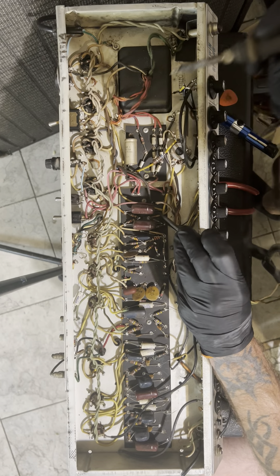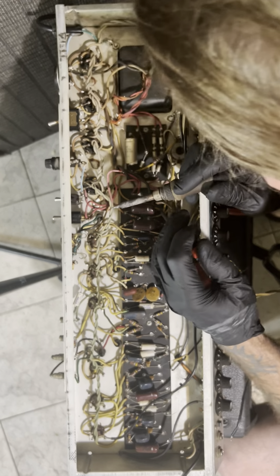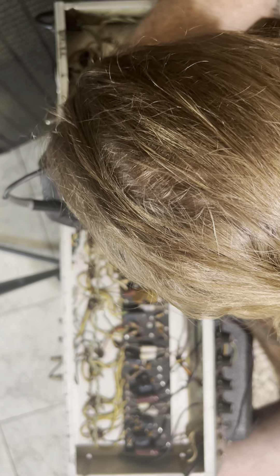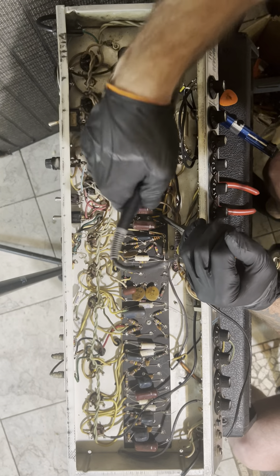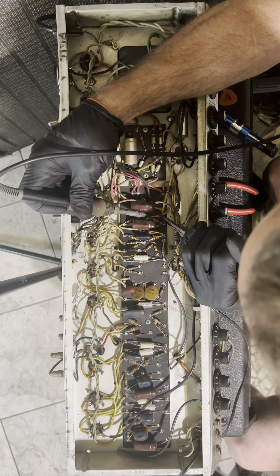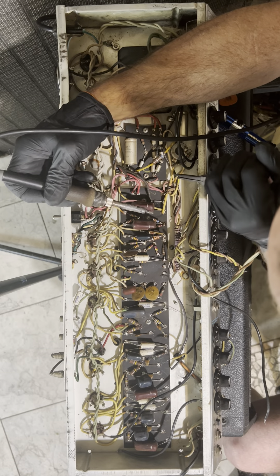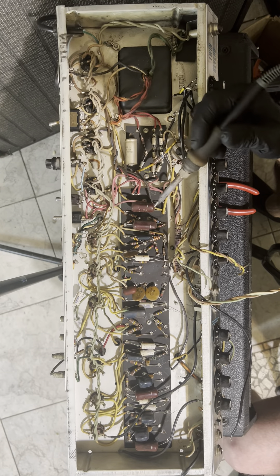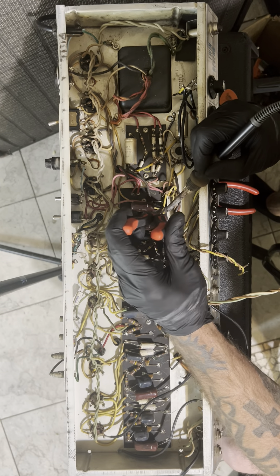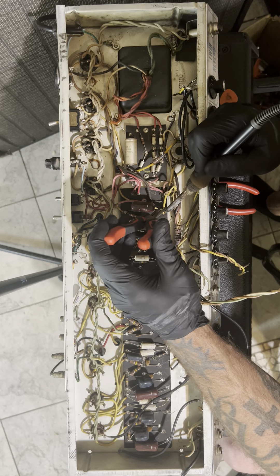This amp — I'll show you right here — it says January 17th, 1972, made by Jay Castillo, C-A-S-T-I-L-L-O. There are quite a few 0.1 µF caps in here — I see four of them. I don't know if I like that idea. They're pretty bassy caps. They're good in some spots; I mean I gotta look at the circuit, I haven't really broken down the circuit too much.